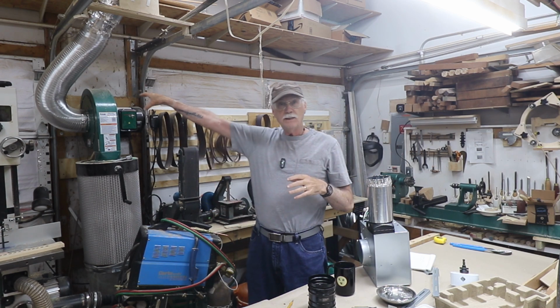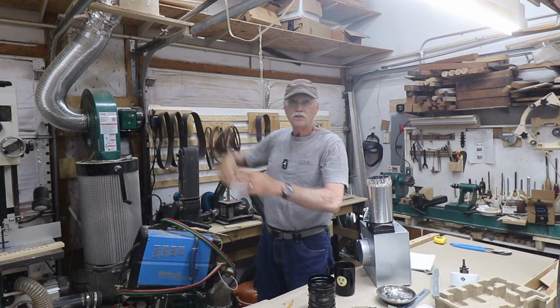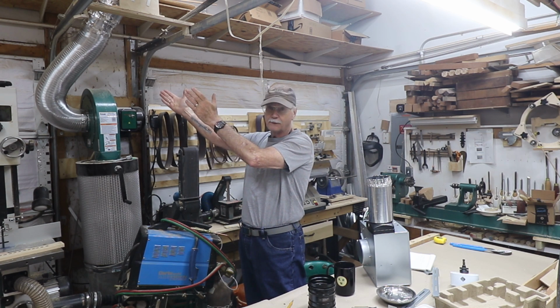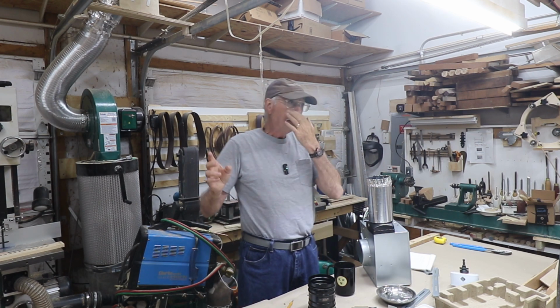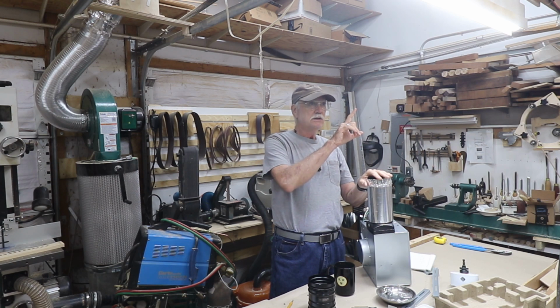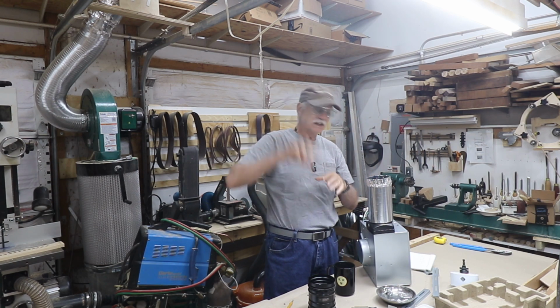It's going out into an empty void, so it doesn't matter. Nothing's going to block it at the other end outside of the house. The distance between the edge of the hole that's in the ceiling right now and the rim joist is 11 inches, so I've got plenty of play in there. I'm going to cut probably a 20-inch by joist width hole in the ceiling to do all the work so I can actually get up there and do it.